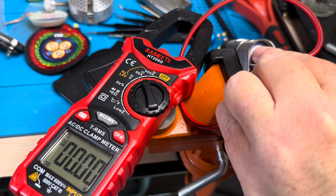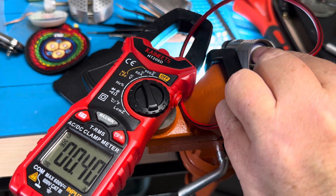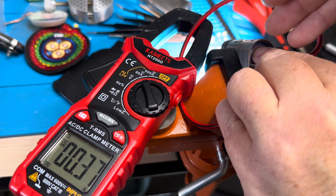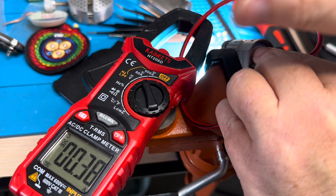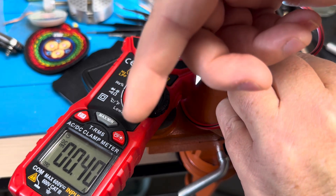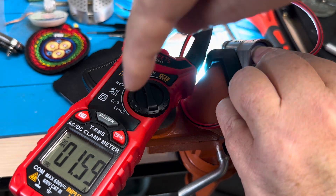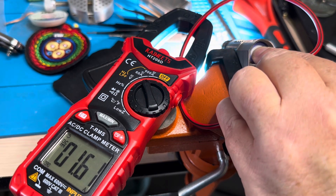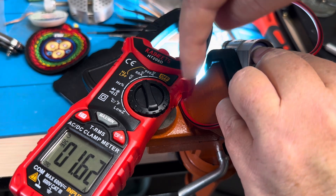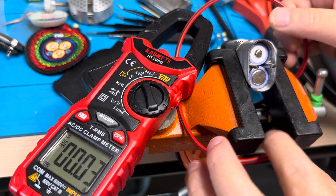I have this set at the second highest mode, which is one amp — I'm reading about 0.4 amps. The reason is this is not running 4.2 volts; it's running 8.4 volts because it's two batteries in series. Remember, Watts equals volts times amps, so the amp reading is going to be half. I'm reading 0.4, which doubled is 0.8 — close to the one amp I'm supposed to be getting. And at 3.3 amps in the highest mode, I'm reading about 1.6 — about half of 3.3. So this is working reasonably well. Don't expect scientific quality accuracy, especially for a meter like this, but this is the way you can measure draw on a flashlight where you don't know what the modes are.